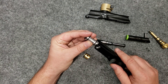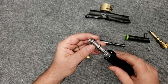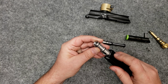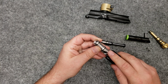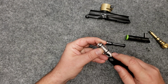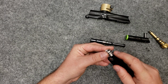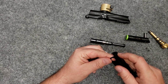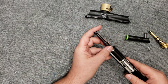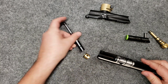As you're sliding the valve back into the body, though, you'll notice we have a front cusp there. With a number 14 O-ring, if you're sliding past there, it'll catch on that cusp and it'll cut. So put it in, make sure you lube generously down around the bottom, slide it in, and hold your fingers here as you slide it in, and that'll ensure that you don't catch on those O-rings and that they go in smoothly. Your finger will only push it in so far, so again, take the piston, push it the rest of the way in until it's seated at the back, and you'll see how it seats back there.